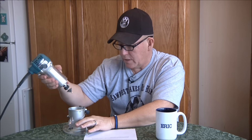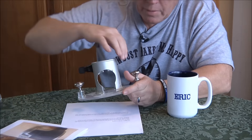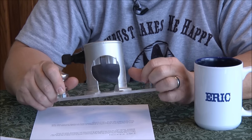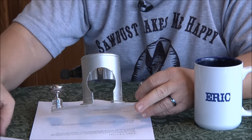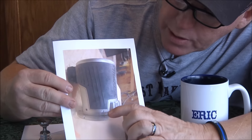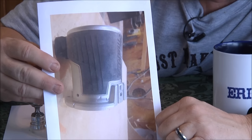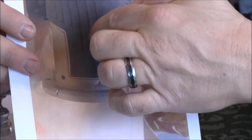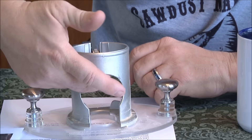I have a Makita that I use for several different things — I use it for carving signs and for trimming. This is my Makita base. What I did was I pulled that rubber off, and then I drilled a two-inch hole. The modification is basically the same as the DeWalts — that's what I wrote him back. What is different from the DeWalts is right here there's a little mounting screw, like a set screw for attachments.